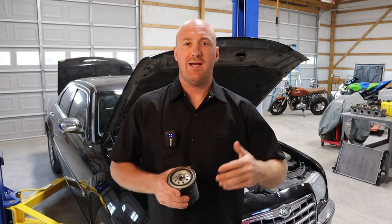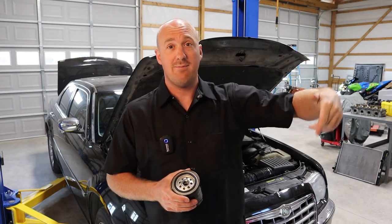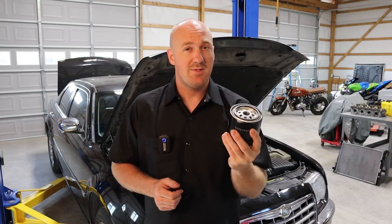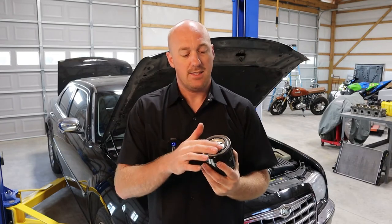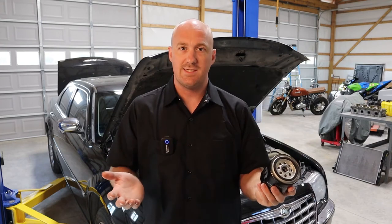It's a good idea, right? Well, is it absolutely necessary every single time you change your oil? No, it's not — because when you change the oil of an engine that has already been running and driving, when you remove the filter you see all that oil that comes running off the filter housing itself. That machine surface where the oil filter goes onto is covered in oil. Does it really make sense to add additional oil to the O-ring seal before putting it on there? Of course it doesn't — the oil is already there, it will spin smoothly.